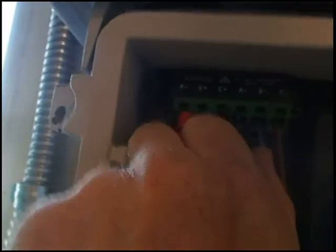Here we are in C, showing 325 volts. In B, 216 volts. In A, 1 volt. We'll get to that — I think that's due to a faulty rapid shutdown.